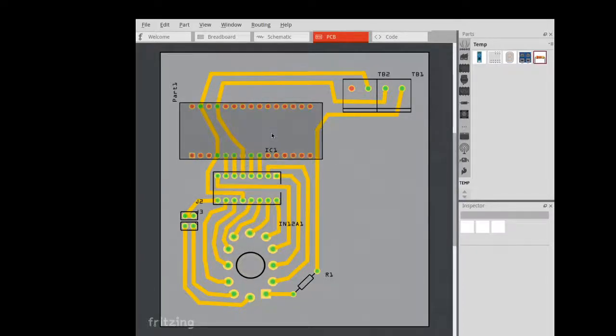On top, you can see the microcontroller, and these are the pins A, B, C, and D. Whatever order they're supposed to be in, A, B, C, D, basically the incoming pins. And those are controlled by the microcontroller here. You can see these four. In the Arduino, it's D6, D5, D3 and D2, the four digital pins that will control this IC.